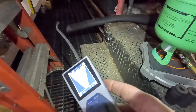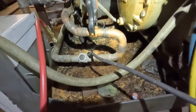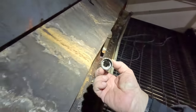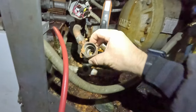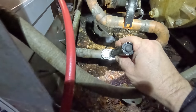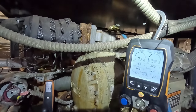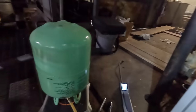Going back to just high mode — it will automatically lock out if it's a bad enough leak. We're still liquidy and I've got 21 pounds in there — the system holds 38. There's the suction one right here — not sure why all these caps didn't get put back on, somebody must have forgot. The water overflow goes down to a spouting and then to a drain. We're starting to get decent liquid rolling through. We're starting to get a little sub-cooling. I'm surprised it worked — it may start leaking again honestly.